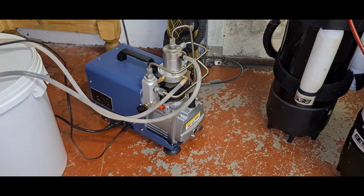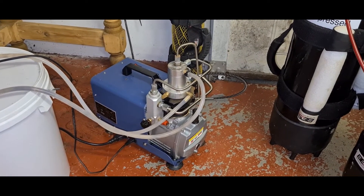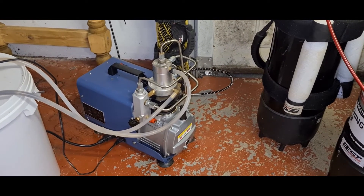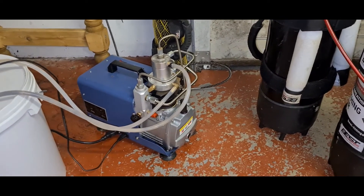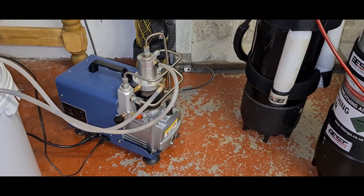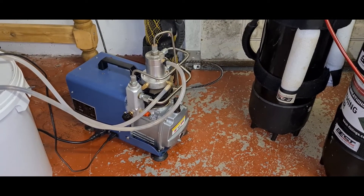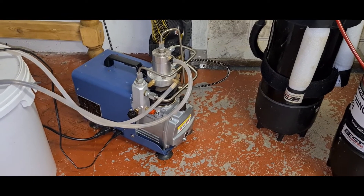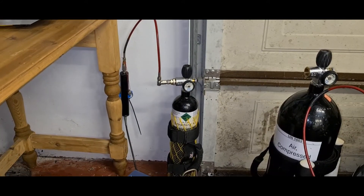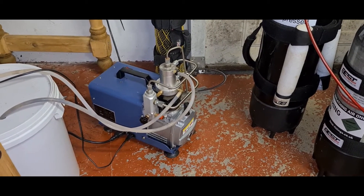Try to make sure the one you're getting is a genuine Yonghang. I know there are copies of it — a friend of mine has got one of the copies and he's had no issues with it, but I have seen other Yonghang ripoffs that have had issues. I would say get the standard version and let it run for no more than 10 minutes at a time. Make sure you change the filters regularly, change the oil, and you should have hundreds of hours of use with it.